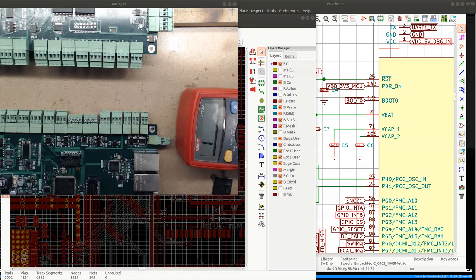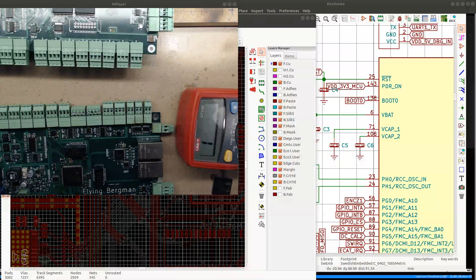So what is going on? This is the CPU that worked on the other board, but it doesn't work on this board. So something is going on here. Something is not right. Could it be somehow that I got some burned BIOS or something? Or actually, that shouldn't be the case, because I tested the voltage on different pins on the CPU, and I was getting 3.3 volts. So what is wrong with this board, which is not wrong with the other board?